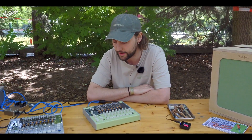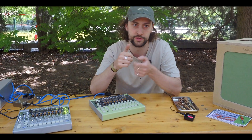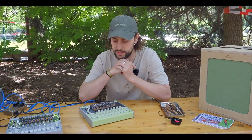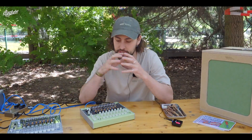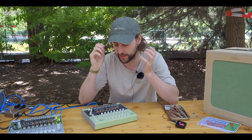The idea of acoustic synthesis is that we have these physical moving bodies — these metal resonators here — and we drive them with an electromagnet to make them move like you would thumb a kalimba, or have a hammer hit a piano string, or a guitar pick on a string. We have a pickup so we get that sound, and in between you have all the electronics that allow you to control and contort that, giving a huge expansion on what you can do with a physical moving body, while keeping all the nuance and expressiveness of that sound. So if you replace the oscillator of a synthesizer with a physical moving body and then have all the synth bits and pieces around it, that's kind of what we're looking at here.